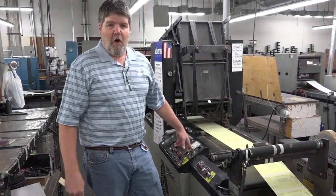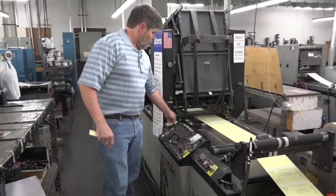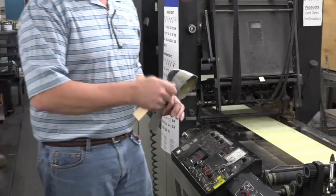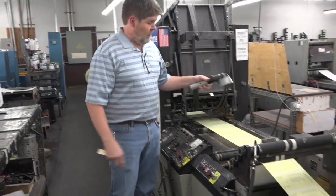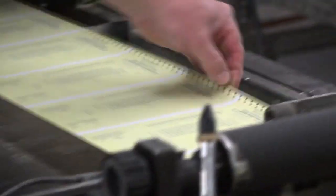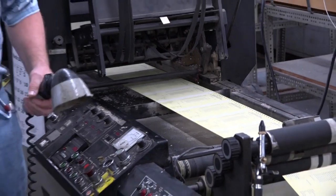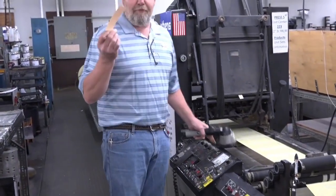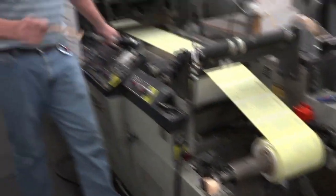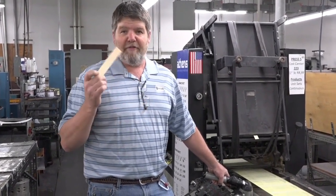When the operator gets ready to run a good roll, he fires it up and brings up an image just like we did for the sheet length, but he's got to take it one step further. We have a strobe light here, and this strobe light runs at the same speed as the press — any time he changes speed it stays in time with it. What that allows the operator to do is see the form while it's running and passing in front of him, so he can check his registration, check the box we talked about, check his colors, even make color registration adjustments on the fly. He can register perforations, numbers, and all that while running. We also put a flag in here. When I'm satisfied that all the forms are good, we put a flag in — that tells everybody down the line that they can run down to this flag and everything's good. Below the flag, it's not.